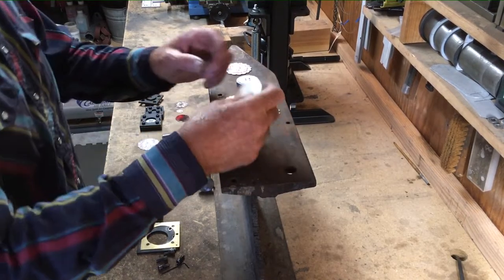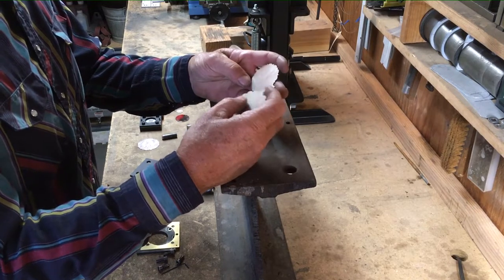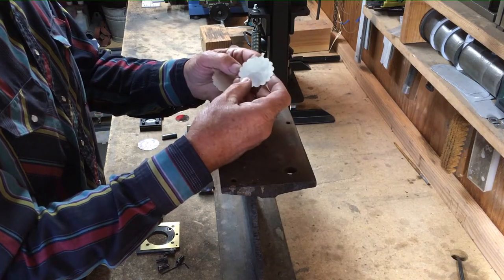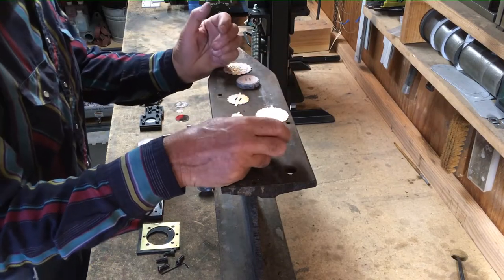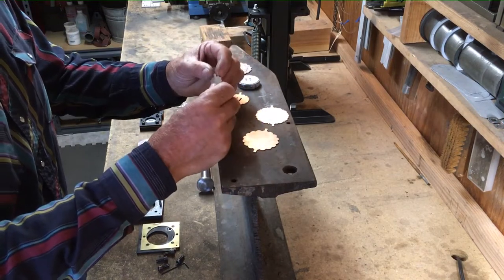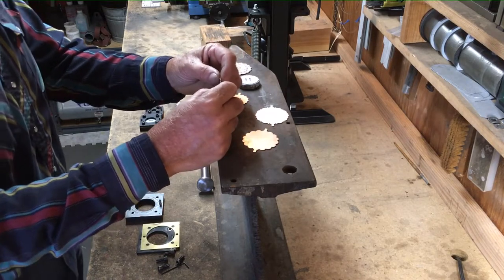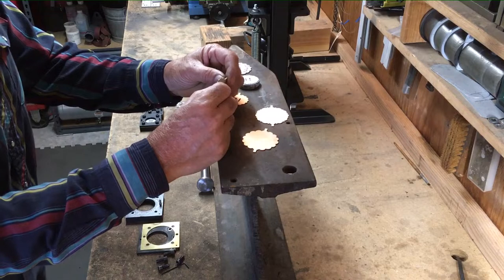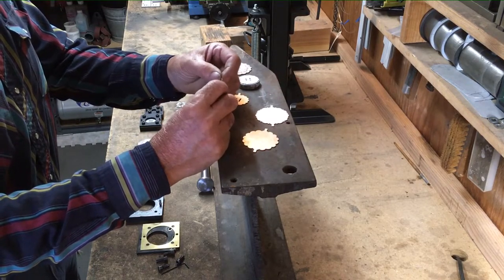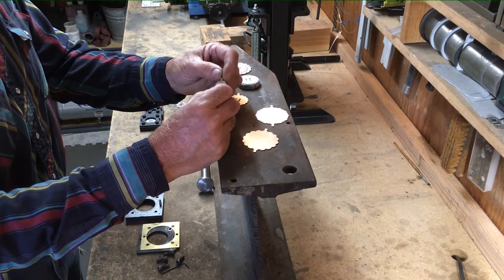With this video, I'd like to introduce Concho blanks and dies that I make. The blanks are available either in this point and scallop, the scallop, or round rim versions. Sizes are available from this little 3/4 inch to 3 inch in 1/4 inch increments. Materials that I offer would be sterling, 25% sterling overlay, brass, or nickel. My standard thicknesses that I use and offer are 16 and 18 gauge.